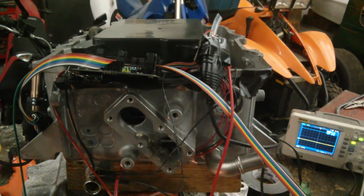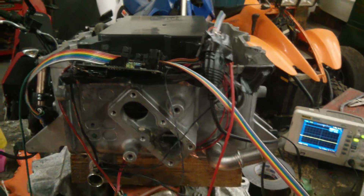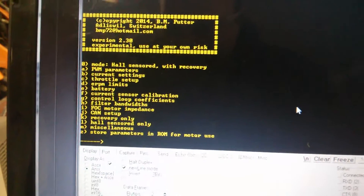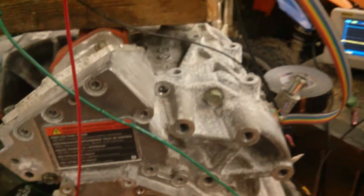I'm just running on 105 volts right now. I'm going to spin it up and calibrate the hall sensors. Basically all you do is you go in — I haven't done this yet, but this should go really smoothly. I just got the signals tested and clean and made sure everything was working good from the UVW sensor down there.